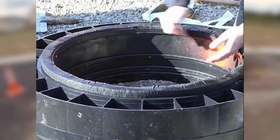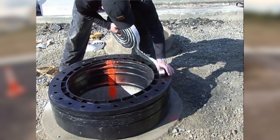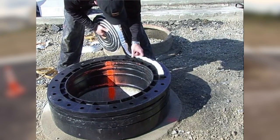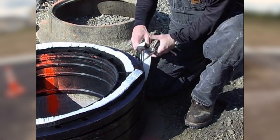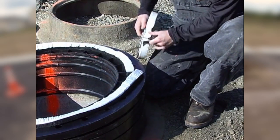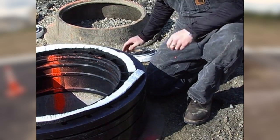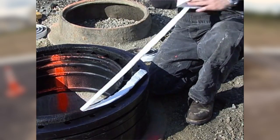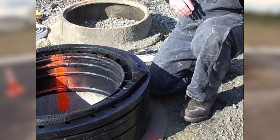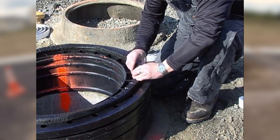Be sure to verify that the sealant adheres to the ring. Continue your installation as normal, but again be sure that you are not using tube caulk. For the last ring, place a 1 inch or 1 and 1/4 inch butyl rope on the flat surface on the top of the ring. Be sure that you apply the sealant on the inside of the perimeter holes. Again, be sure to cut the ends of the butyl rope rather than pull it apart. Once cut, be sure to knead the two ends together so that you cannot see the splice.